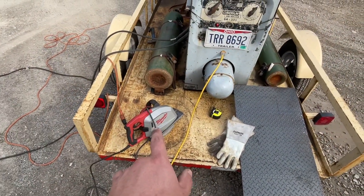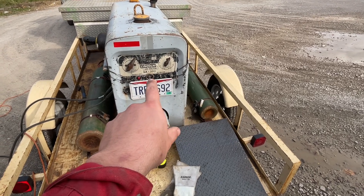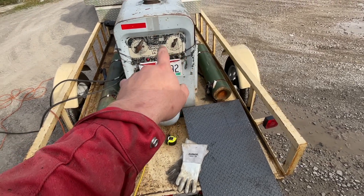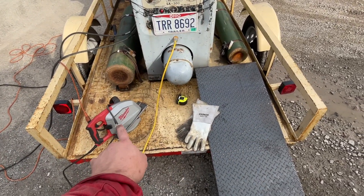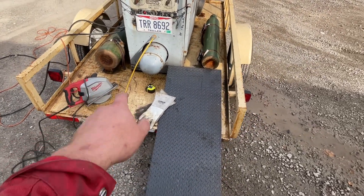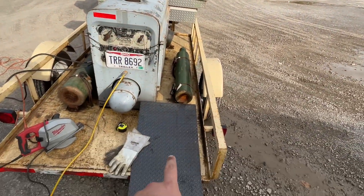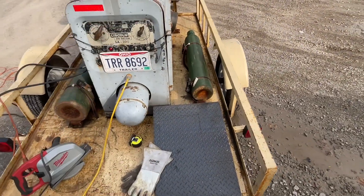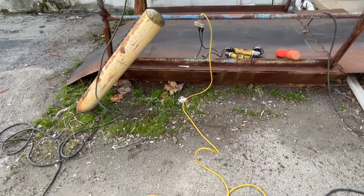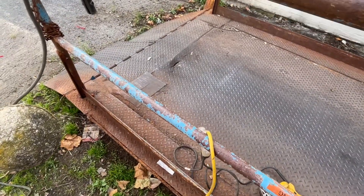But I'm using this saw. If you're another welder using these big Lincoln SA-200s or even the 250s, do not use that machine to power the saw — you will burn it up. The way around that is just get a battery saw. I like the corded ones, so I use the generator to cut this. I'm shutting the generator off and firing up the Lincoln. I'm gonna weld-clean this all up and weld that plate in with the Lincoln.